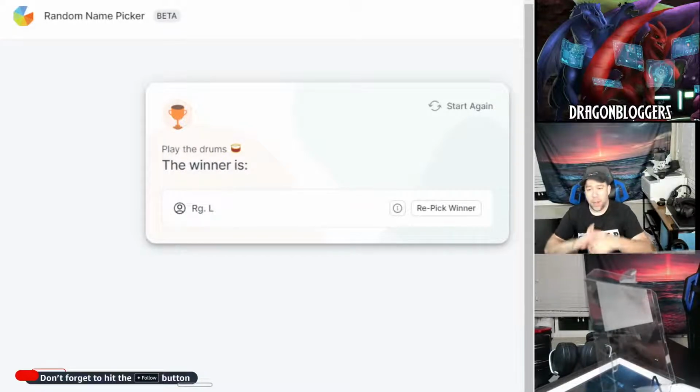Again, thank you everybody for joining the stream tonight. I apologize about the camera technical difficulties. I'll research why my Sony ZV-1 wasn't charging while I was plugged in USB while I was on HDMI, because I read that it should be able to. I'll also find out why it kept shutting off via timer while I was over HDMI, because it had a full battery and it obviously didn't even last the full hour and 45-minute stream. So I'll be working on that. The resolution was excellent. Battery life, I have to figure out how to solve. And I'll probably document what I did to fix it next time.